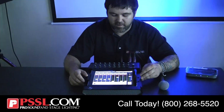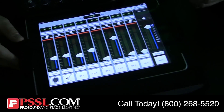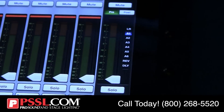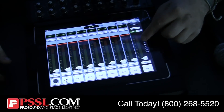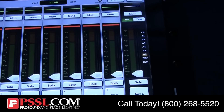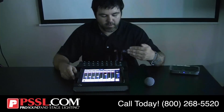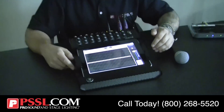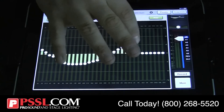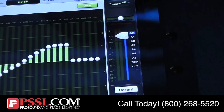The other portion I want to show you — this is our main mix; you'll see the LR here, left-right, front of house. Now let's say we want to do a different EQ for one of the six auxiliary outs. You simply go over here and select auxiliary one. This is where you would do your mix for auxiliary one, and you can go into the various different mixes for your auxiliaries as well. Each mix, from the front of house all the way through auxiliaries one through six, has a full 31-band EQ. You can individually dial them in, or one feature I love is you can actually draw it in if you're doing your typical mix. You can do that from front of house all the way through auxiliaries one through six.